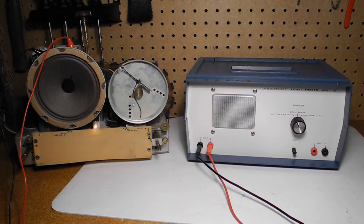In speaker substitution mode, the internal circuitry is powered off and the internal speaker is simply connected to the speaker jacks. The unit can be used as a known good speaker for testing devices such as radios. Often when removing a radio chassis from the case or cabinet, it was not convenient to remove the speaker, so the instrument allowed the service person to leave the speaker in the radio and use the one in the signal tracer during testing.